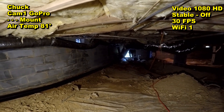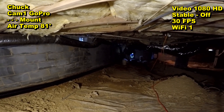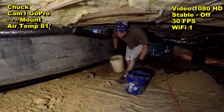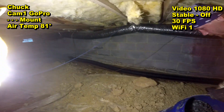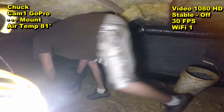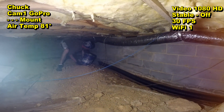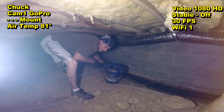The labor part of this job is not really the digging — it's bringing in the gravel. Bring it in gravel by the bucket, by the bag, by the tub. However you bring it in, it's a lot of labor. Each one of those buckets weighs about 50 or 60 pounds. We're just going to be pouring it over top of the pipe. We've already got a small base of gravel underneath, but a lot of labor, a lot of wires to go under and over in your crawl space makes this the hardest part of the job. You can see how far a bucket actually goes — it doesn't go very far at all.